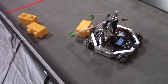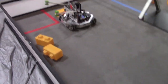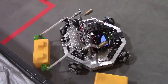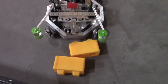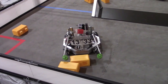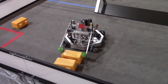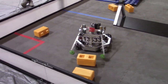Let's move on to the intake mechanism — I think it's quite interesting. Tell me about the inspiration behind it. We wanted to pick up the blocks and stack them higher for more points. We had some struggles because the servos couldn't pick them up — the block was too heavy — so we added counterweights and kept trying different styles to see what worked best, and this is where we are now. That's a big part of FIRST: iteration, always trying new things. We went with compliant wheels in front because they're more grippy, more steady — you can pick up and hold blocks easier and drive really easily with them.